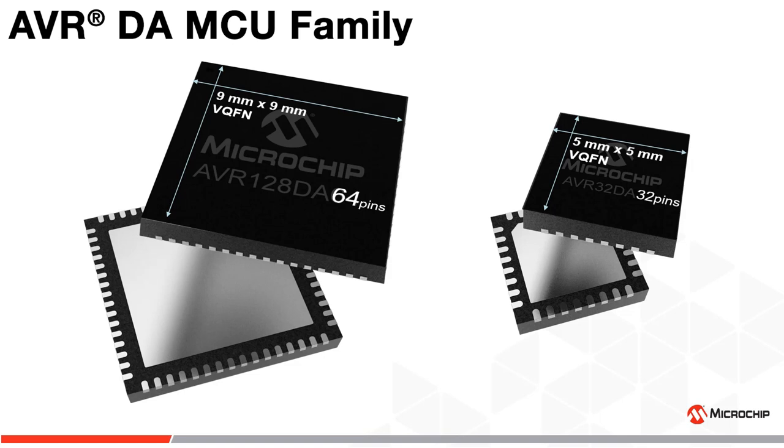Microchip's AVR DA family brings easy real-time control functionality to the low power performance of the AVR microcontrollers, which makes them not only good for standalone processors, but also great companion MCUs in designs that demand precision. The device family currently offers a variety of package options from 28 pins to 64 pins. The 32-pin VQFN package has a footprint of only 5x5mm.